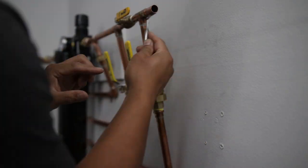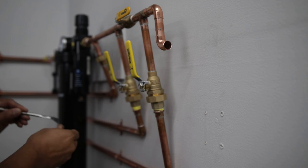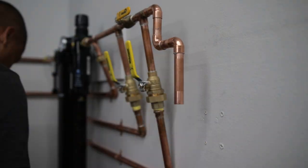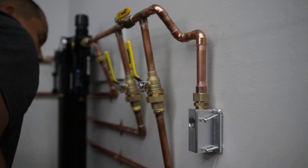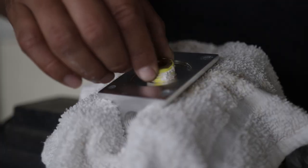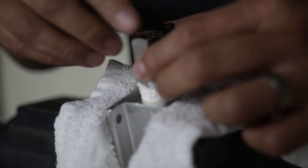Because I would be adding an air cord reel in the near future, I installed the manifold block to help split the air when needed. To easily locate where it needed to be, I did a dry fit of the section and then pushed it back to see where the mounting holes would need to be. Then I took it back off to install the air coupler, supply plug, screw, and ball valve.